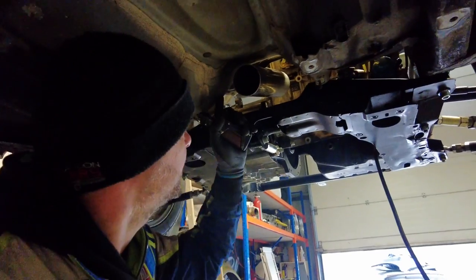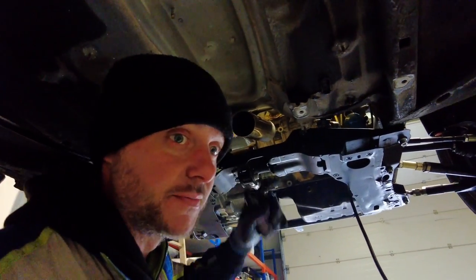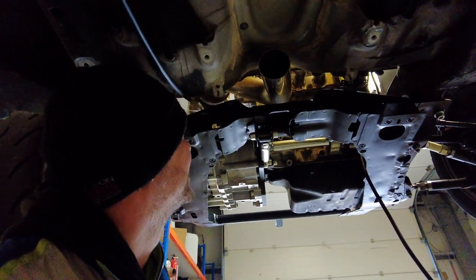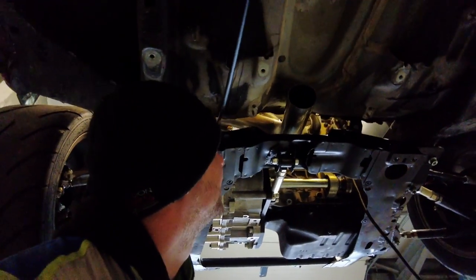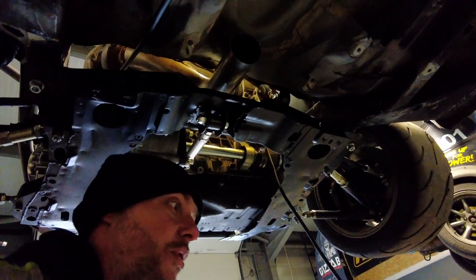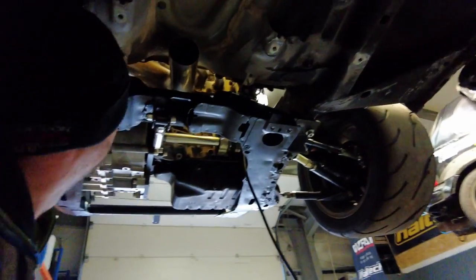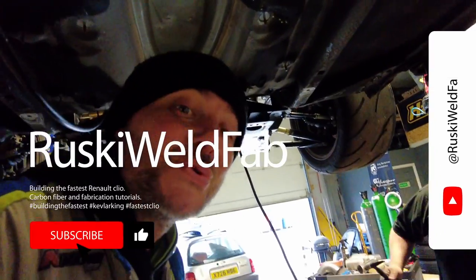Pretty happy with the position. That's how it's going to come out. A little clocky, small bend, and a very nice, low angle downpipe. It's not even a 90, it's less of a 90, more of a 70 degree bend in the second one. Get the compound angle. So it's a 45, 70, and then barely a 20, maybe 25 degree angle, so very nice, smooth flow and transition.